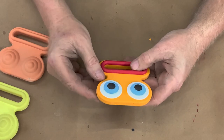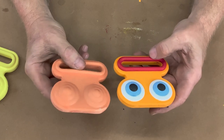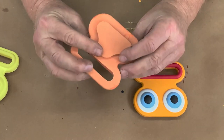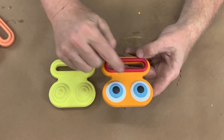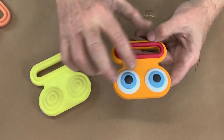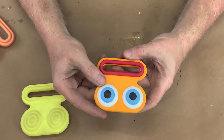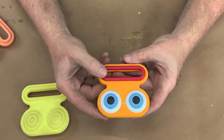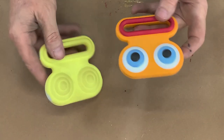It's a pretty clean casting, but there are flaws, and in order to have this be pristine you'd have to go through and repair it. This is why a long time ago I came to prefer solid resin castings that you then paint to the finished look — I think painting resin parts is a lot easier. This is one pour; this is five pours. In a casting like this, if any one layer fails, the whole casting is shot. It's also very hard to mix and predict colors accurately. The truth is resin colors fade and yellow over time, whereas good quality artists' paints don't. At the end of the day, this object when painted will be a much higher quality than this object done in colored plastic. I hope you had a lot of fun — watch the next video and I'll see you next week.